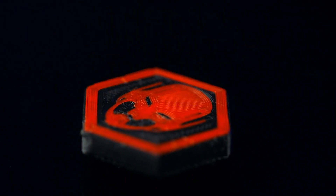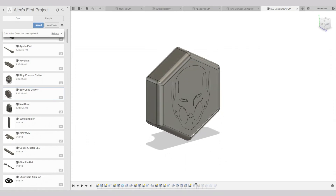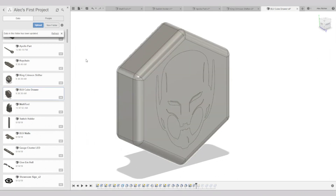The first layer inlay is something I heard of from Devin from Make Anything about six months ago. He described a process where you print a part, don't remove it from the bed, and just print directly over it to create a dual color 3D print. The setup is very similar to the separate piece strategy, except you can't do complex tops — the inlay will be completely flat.